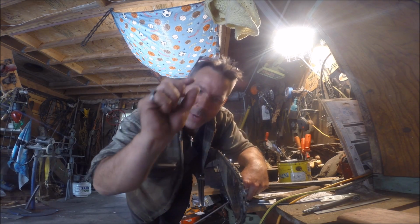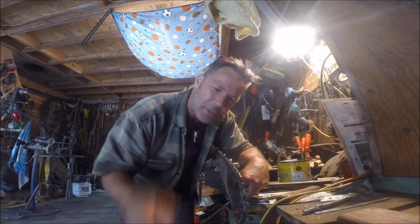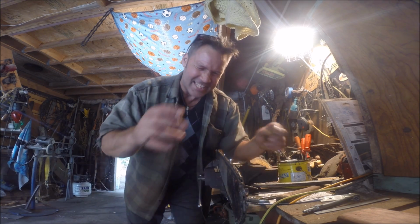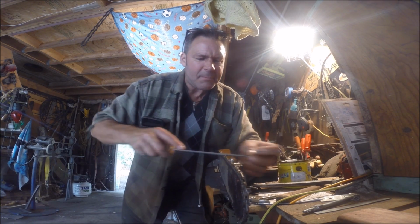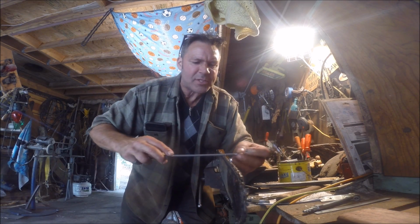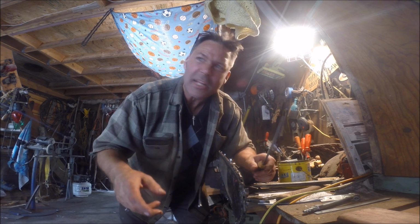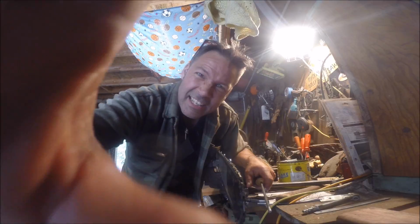Then pick up a raker gauge and file your rakers, which is that little thing in front of the cutter tooth, which invites and throws chip into the wood. Just sharpen it till it's sharp, friends. Counting wastes space in your mind. Just file it till it's sharp. Plus, I could be going 1, 2, 3 gullet strokes, and then I could be doing a custom little cleanup stroke, light, not even hardly doing anything. You know what I mean, friends?